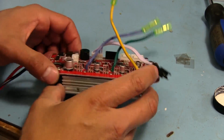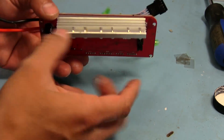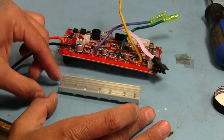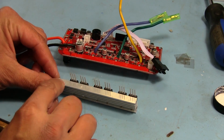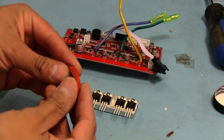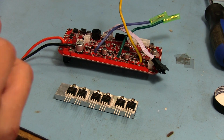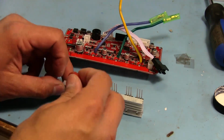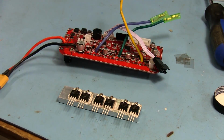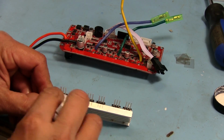After mentioning all that, if we're going to try to be thorough here, let's be a little bit more thorough. Now that all these are clamped down, let's pull it out. Just to minimize vibrations even more, I'll put a thin strip of double-sided adhesive here, which I have right here. And that will hopefully keep the heatsink stuck to the board just a little. Actually, before we do that, let's clean it with alcohol to make the stickiness maximum, so we get it to stick properly here.